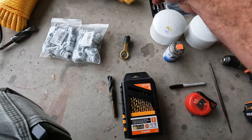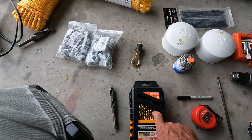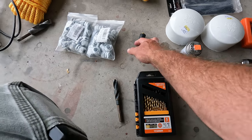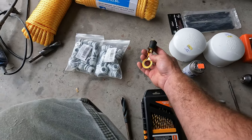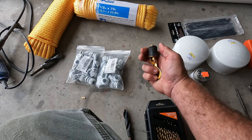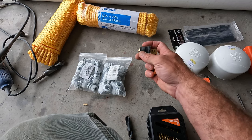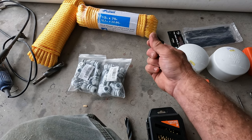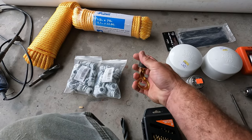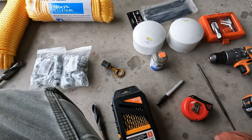You'll want to drill pilot holes and step up in sizes so you don't stress and potentially crack the plastic with that big bit going straight in. You'll also need a drill bit set. This here is a boat plug — it has a piece of rubber that expands when you flip it and seals the hole. You'll want this for your fill hole where you pour your material in. You'll also need a permanent marker like a Sharpie and a ruler.